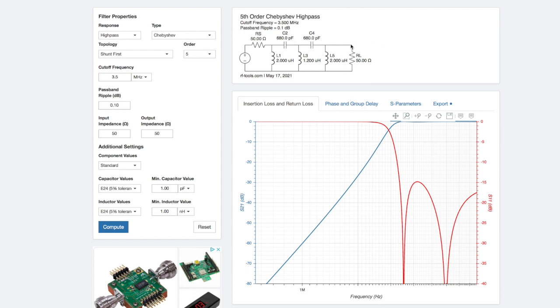What we've got are three inductors. The two end ones are mirror images of each other — two microhenries each — and the middle one is 1.2 microhenries. Then two capacitors, both 680 picofarads. Not too bad. Once you've got that, that's basically most of the work done. These are standard values, so they're not too difficult. If you don't have them you can make those values up by combining capacitors, but the inductors you need to think about a bit more carefully. The next thing is to work out how we're going to get these values of inductance — we're going to wind our own.